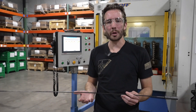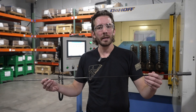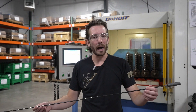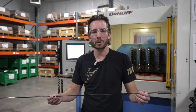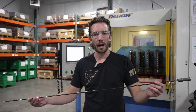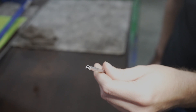We just took a look at our nine millimeter drills for our pistol barrel operation, and now we're going to compare that to our deep hole gun drills for our rifle barrel operation. This particular drill in my hands is a quarter-inch drill for drilling 6.5 millimeter caliber rifle barrels. It's about 200 times diameter in length. You'll notice it's much longer than the previous one, and if we take a look it has a single flute on it as well as coolant passages just like the last tool.